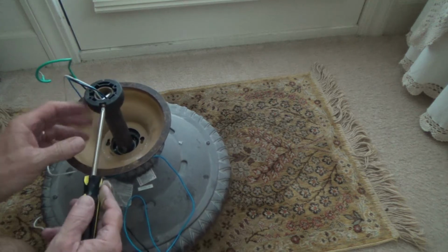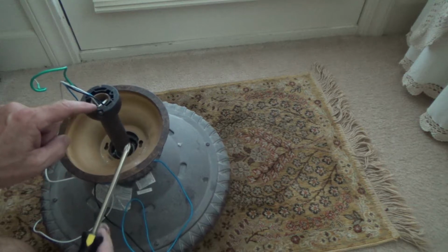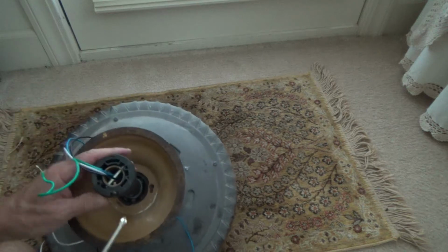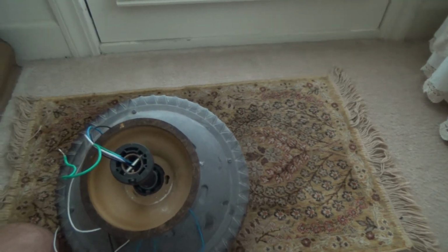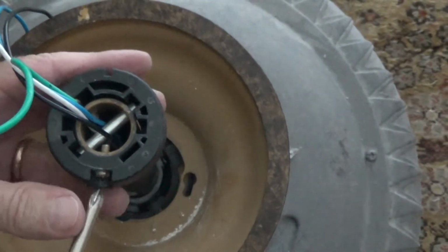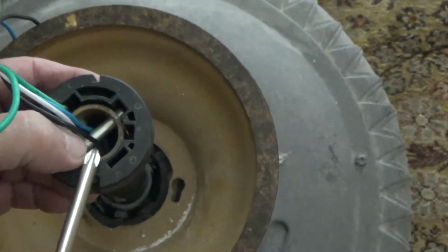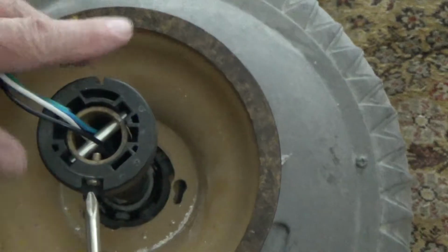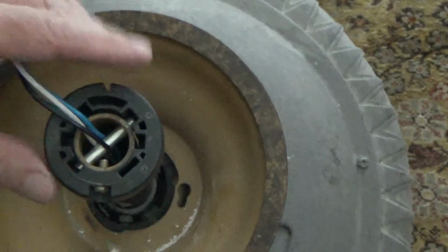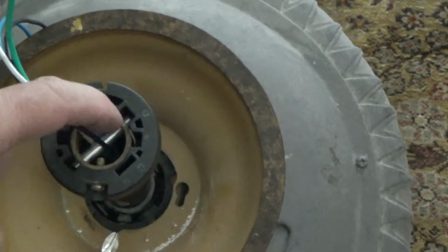And sometimes this set screw just goes through the plastic and it will have threads, and it just pushes against the metal riser pipe, okay? But for this particular one, I thought that's kind of good. You see where this screw is? See how it actually goes through the metal all the way. Most of them don't do that, and that's why this knuckle sometimes gets loose on this riser pipe, because the screw usually is just pushed and indented into this pipe.